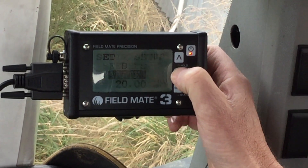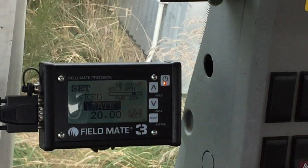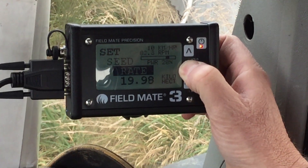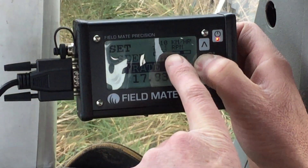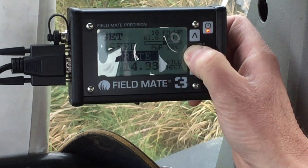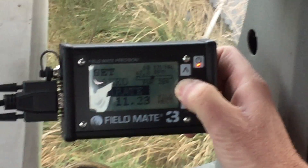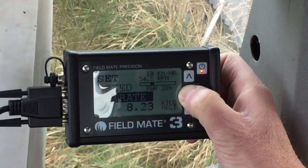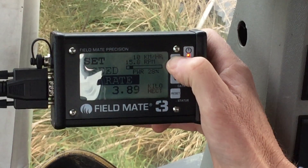The other thing to do is set our drilling rate. We know that the bin pushes out 300 grams in calibration. Now we just want to tell it what our kilograms per hectare are. In this case we'll bring it down to five kilograms per hectare. The bar graph here tells us how fast the motor's going to turn when we're doing 10 k's an hour drilling. As we bring this down to our five kilos per hectare setting, you'll see how the revs are back-calculated to tell us how things would look if we were doing 10 k's an hour while drilling.